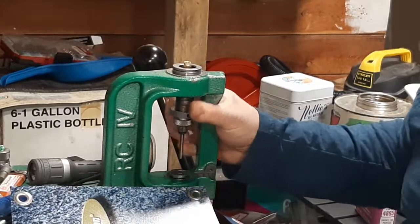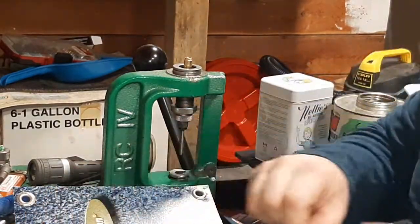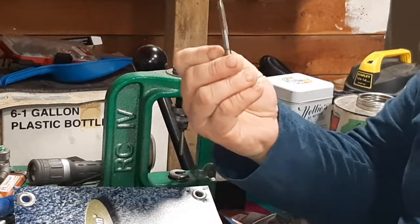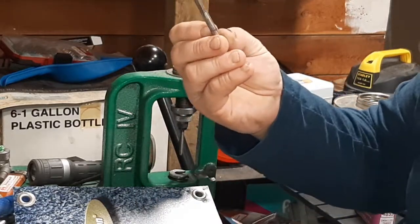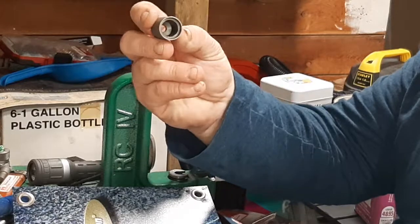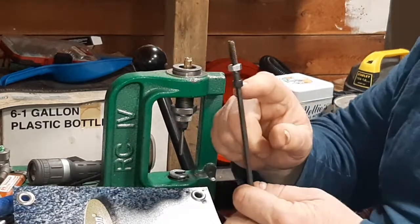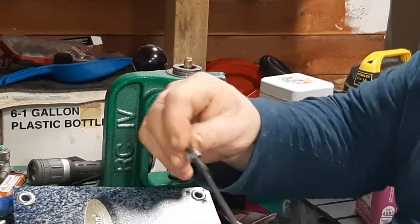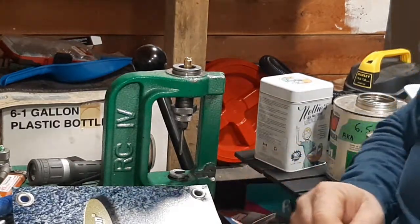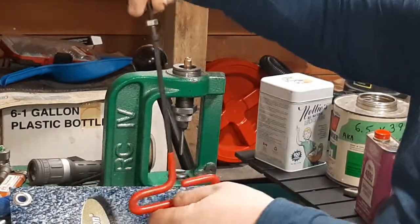And then this is the way I found it to be done easiest, is you thread it into your press upside down, and then in the kit you get a number 7 drill bit, 1/4 20 tap or die tap, and a little metal cup. And 1/4 20 nut and bolt. The bolt is Allen key headed. So, and the kit comes with an Allen key. I've since replaced my Allen key with this.